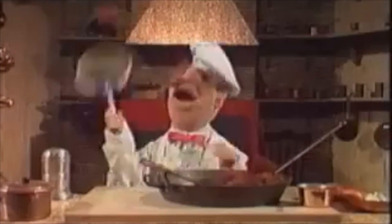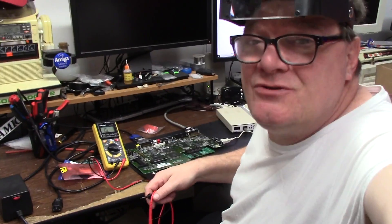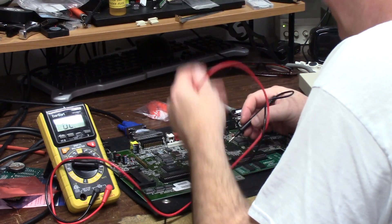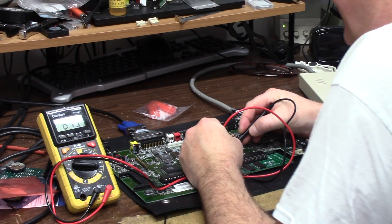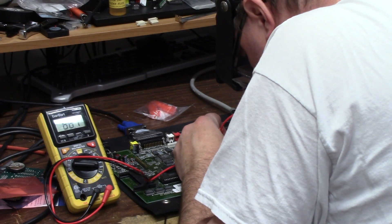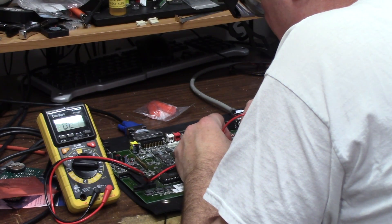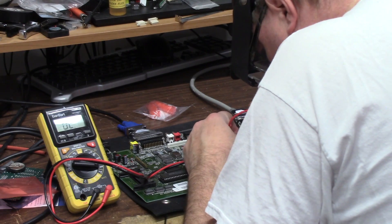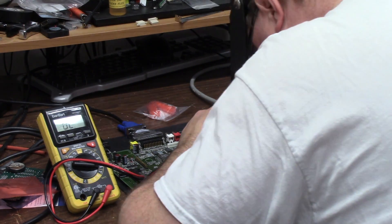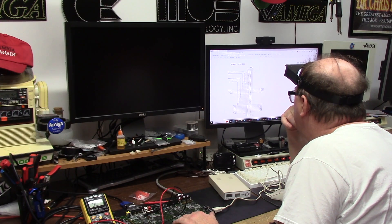This schematic is from amigawiki.org. I'm going to zoom in — this resistor is going to change. The units are off by the way: 681... off. This one is 679, this one is 680, this one is 679... 471. Hey, guess what's dead? He's dead, captain — resistor. There's a negative 12 on the top.